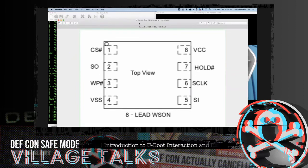But in reference to doing that, again, like he's showing here, go ahead and get the data sheets, figure out what you're grounding out. So literally you don't just smoke something. To randomly go into a device here and go, oh, I think I'll just start grounding stuff out, it's almost a guarantee that you will brick the device permanently.